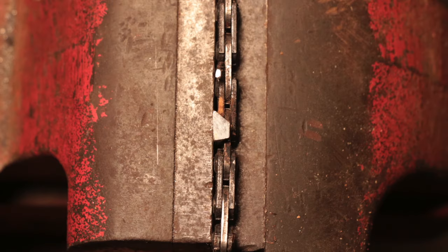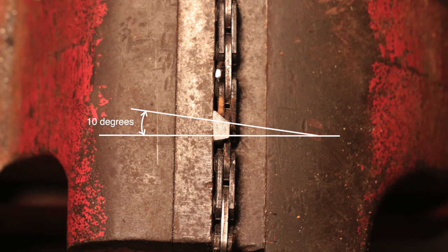Yes, Thomas, I do recommend these two attachments I've already talked about. As far as the ripping chain is concerned, early on when I first started the workshop project, I didn't have access to a proper ripping chain. So I took a normal chainsaw chain — the kind you'd use to cut firewood — and sharpened the teeth to a very narrow degree. After that, I got tired of sharpening them to 10 degrees, and for convenience sake I just started using regular chains. Regular chains work; they're not the best, probably.